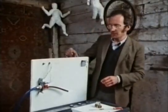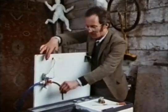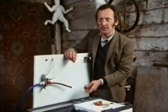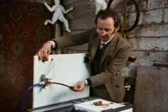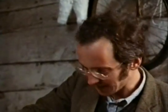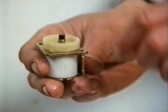The first thing that happens when you turn the machine on is that water gushes in, released by a sort of electric tap called a solenoid valve. Simply pass the current through it and the valve opens. The clever thing about these valves is it's just a small cylinder and a small coil, and it has to resist the full force of mains water pressure, so I have to put my flat finger over the head quite hard to stop the water coming out.